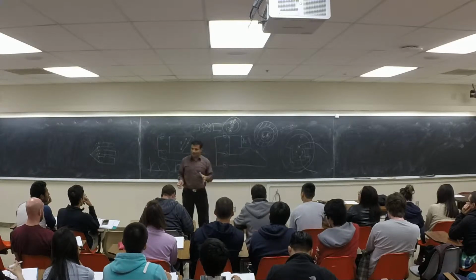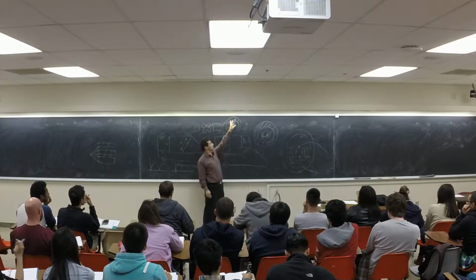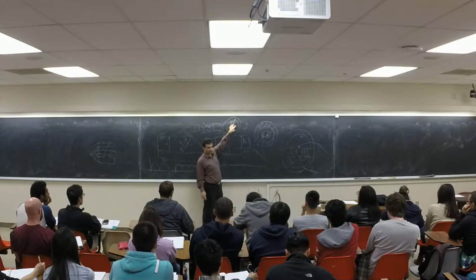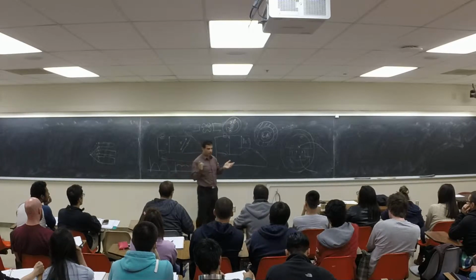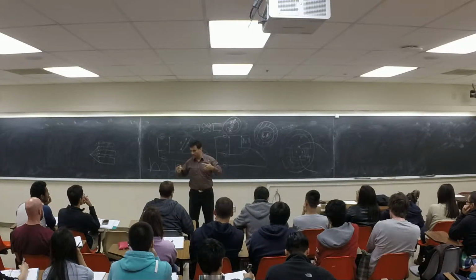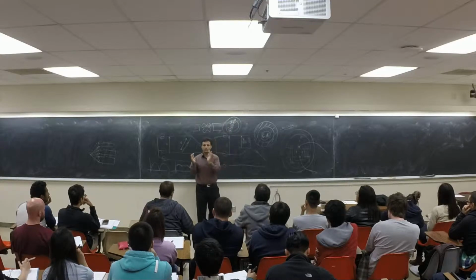The reason the permanent magnets are very good is that instead of putting these windings, you have strong magnets, right? You want to create a good magnet here. If we have a big, very good, natural magnet, you don't have to put a winding here, and this structure is going to make the machine very small. And it is a very strong magnet. Remember, we were talking about the torque and force. The torque and force is there because of the reaction of two fields, right? The bigger the magnets, the better. So if you have very good magnet materials, you don't need to put lots of winding here. Put very strong magnets here, because the machine is very, very small.